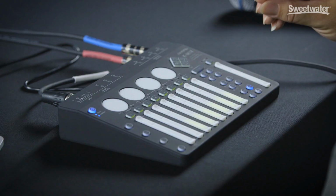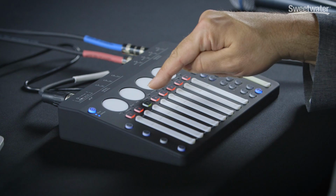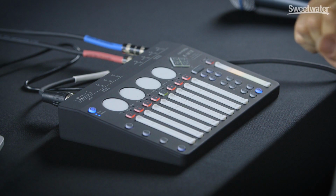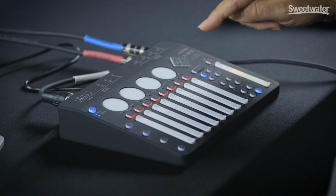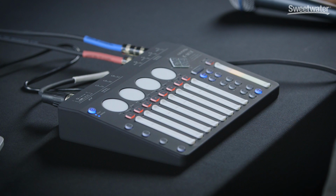Finally, we have the headphone mode. When you select that, you're assigning the different inputs to the headphone output. So we can choose each of our individual inputs, sort of a PFL type setting, also great when you're recording for soloing of different instruments. Or we can choose main, and in this case, your headphones are going to feed straight out whatever's coming out of the main outputs. If we're using this as an audio interface, you can also feed from your DAW straight into the input channels or straight to the stereo bus and out the headphones.